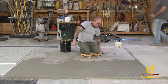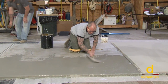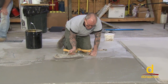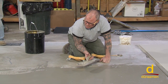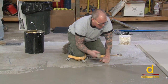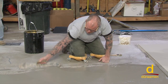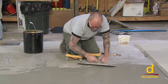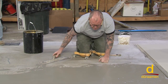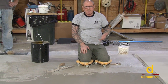So you'll notice my trowel pattern too. I don't just do this. That doesn't look organic. So in the event perhaps we had unlevel concrete and we do get some trowel lines, it looks natural to have overlapping patterns. Now, especially if we were to come back and stain it, it actually adds some interest. That's how the hand trowel works.